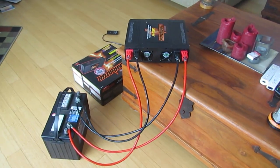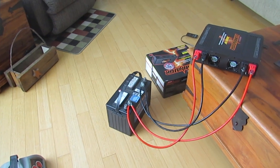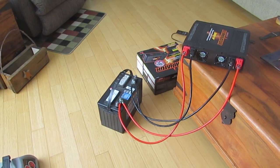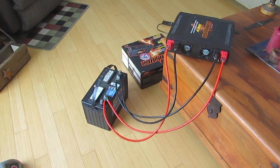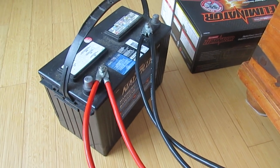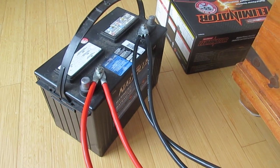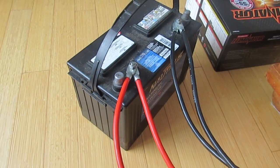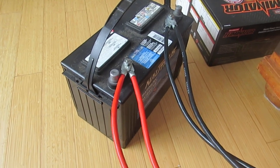Once you've got all four cables connected, introduce the battery. Keep the battery away from the whole setup while connecting the cables — it's only when you connect the battery that things can get dangerous. You have to connect the cables in a certain sequence: the black is to be connected to the negative terminal before you connect the red to the positive terminal. Do it the other way and you're going to get sparking.